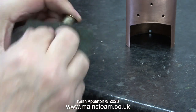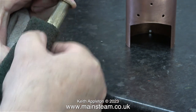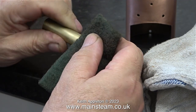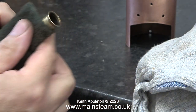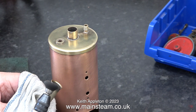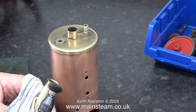Here I'm cleaning the chimney. This was heavily coated in some sort of varnish, and because this part over the years has been the hottest part of the engine, the varnish was very well baked on. But by applying some of this Astonish cream cleaner with a piece of Scotch-Brite, the brass chimney was very easy to clean. For the curved part at the end this was more difficult, so I used a rotary wire brush just to get into the tight curve.